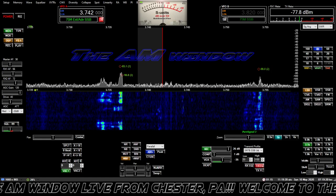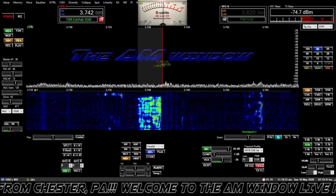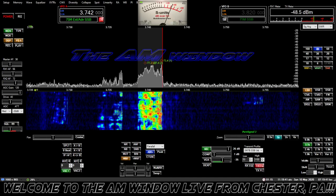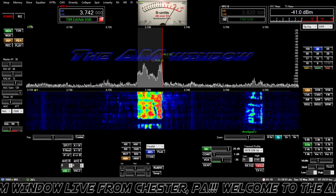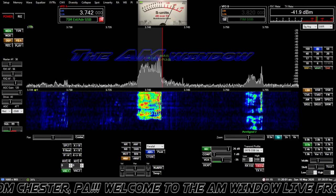About my shack, when I built this office, I put in a totally separate meter. Let me just make one comment. If I had a generator like that, I wouldn't want my radios coming on without me knowing about it. After a power failure, I want to reset my radios independently. If a generator comes banging on, you don't know what kind of a spike that's going to throw out. My electrician was like, you sure you want 50 amps at 240 to this plug? I'm like, yep, I'm sure.